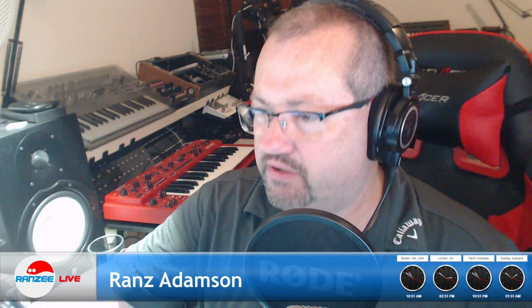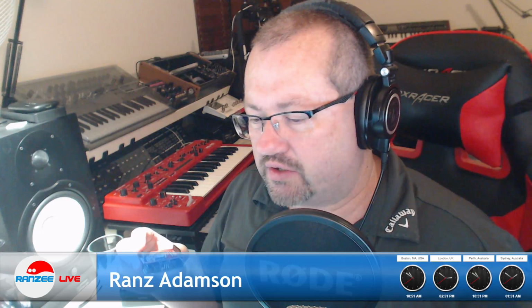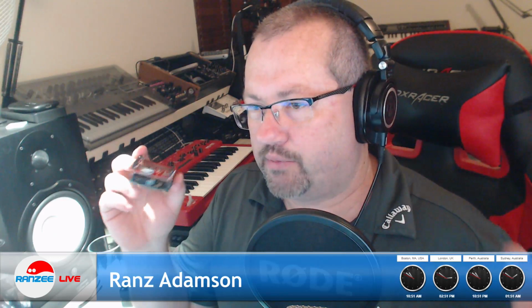What you can use this for is you plug your Arduino into your PC, you put some programming code into it, and now I've got myself a USB host. Then with a bit of wiring out of these plugs, I can connect up to a MIDI DIN, and I can make myself a USB to MIDI host without actually having to use a PC. So if you've got a USB controller and you need to convert it to MIDI, this is a little project. I'll do this one very soon on the channel. It's not something that's original, people have done it before, but I know there's people that love this sort of stuff. So there's that.